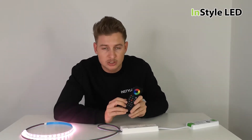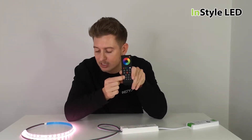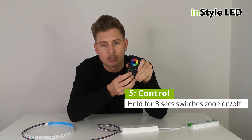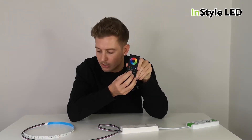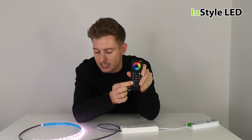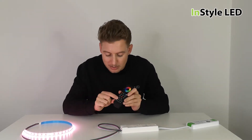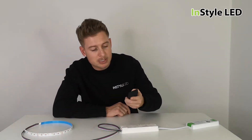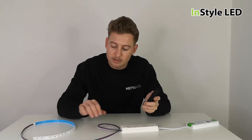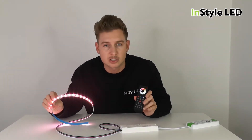What may happen is you want to turn off just zone one, or you may accidentally have turned off zone one by holding zone one down for three seconds. Zone one is now off. So if you turn the big red button on and off, that light will never come back on until you hold down zone one for three seconds and it will pop back on. Someone may have held down zone one for too long on the wall controller and be turning on and off repeatedly with no result. Be sure to hold the zones down to check that you've just not accidentally turned that zone off.